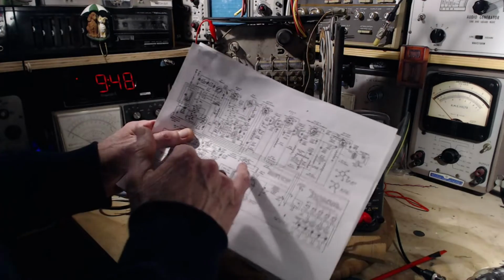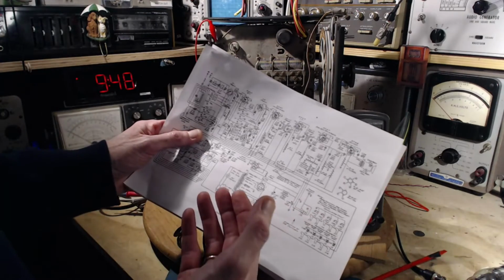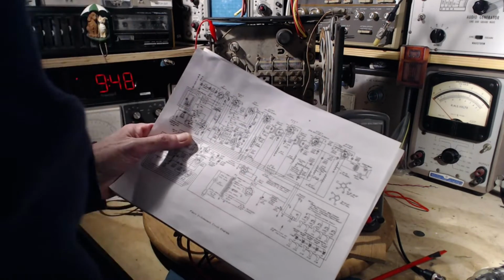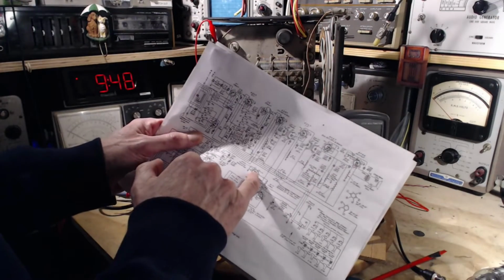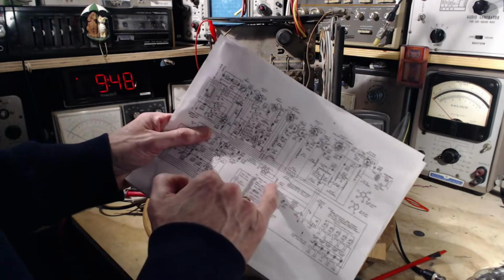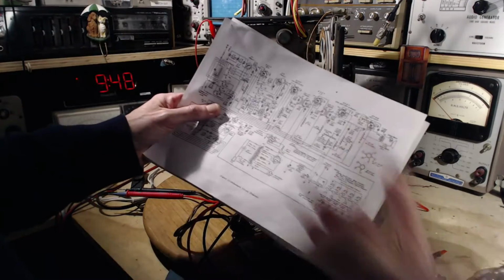Can I just simply stick a million, maybe a 1.4 million, in parallel with that to get it back to a million and just do it down in the radio? No, because they don't bring the plate wire down into the radio. The whole idea is put the resistor in the back of the socket and you save a wire.